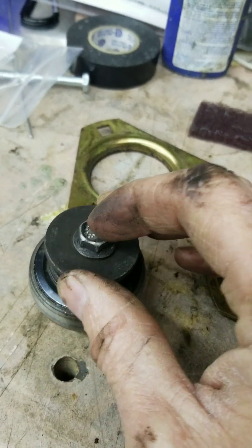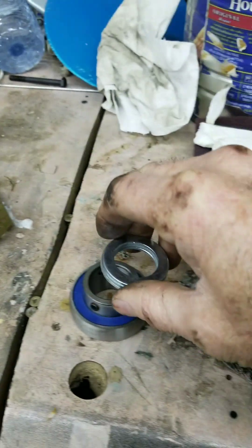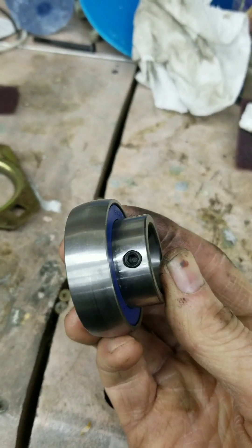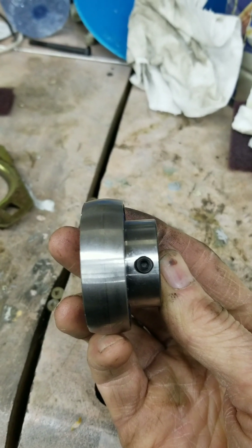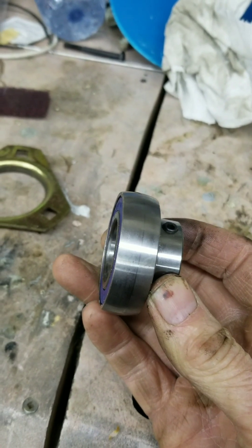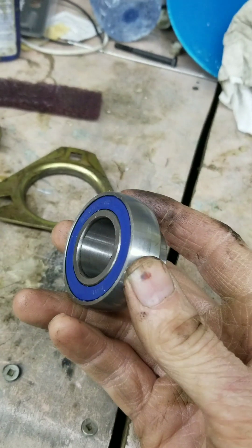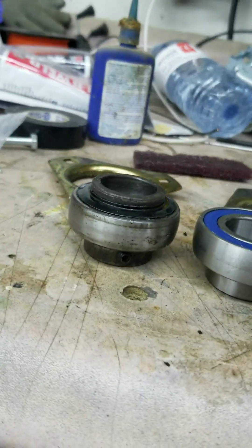At the end of the day I've got a solution for this. There's a very common bearing out there and it's used on many snow machines and other applications. This one is an SB — that's Sierra Bravo — 205-16, and obviously the dimensions are somewhat different for the collar because the inside collar is identical, so this side is perfect. The back doesn't have the stick-out collar like this one does, and you can see it's not there.